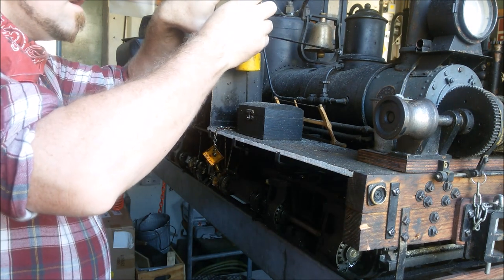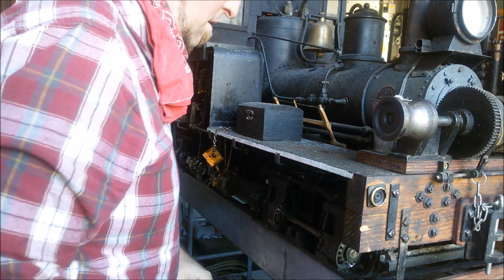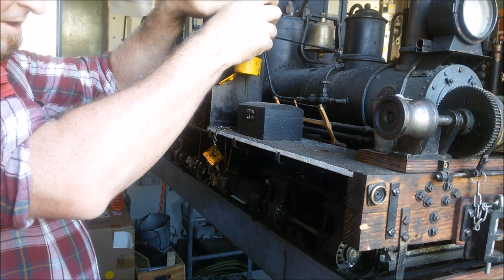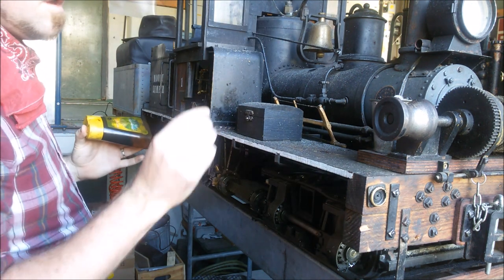overview. I start with filling the steam oil lubricator for the cylinders. The lubricator will pump the oil into the steam pipe just above the steam engine. The oil will be transported by steam into the cylinders and lubricate the pistons.